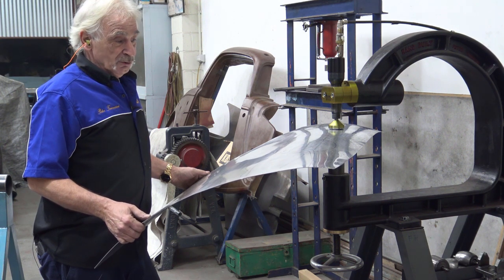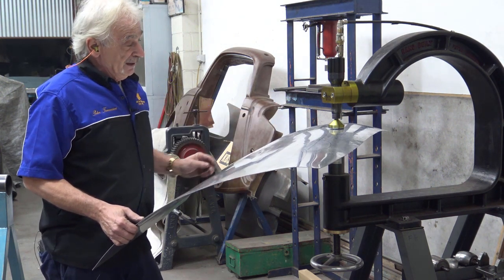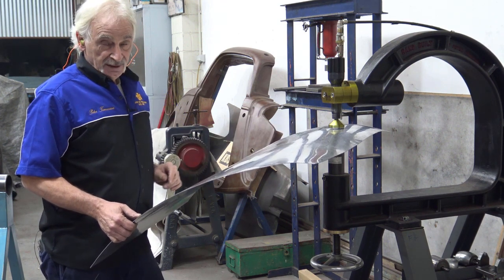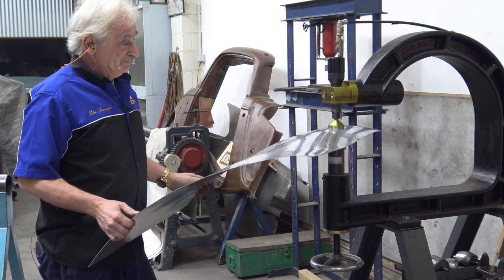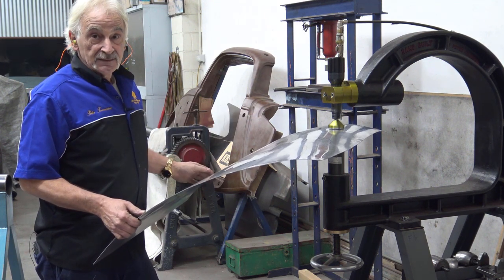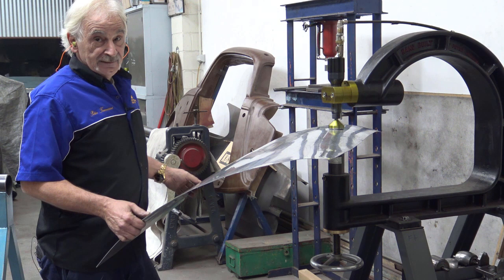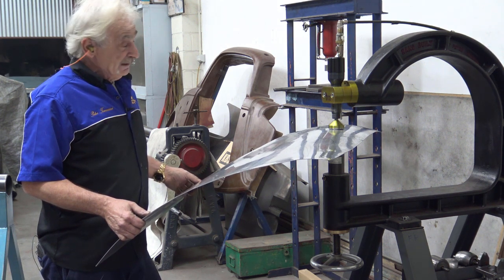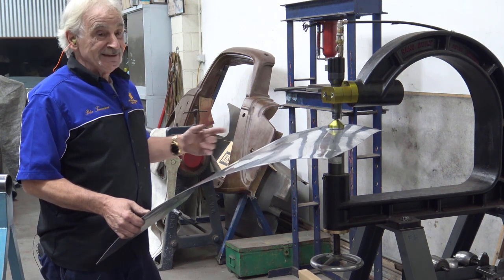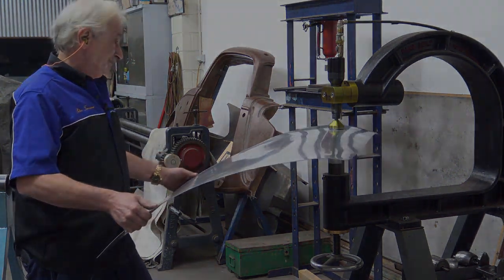And what you see me doing is keeping away from the return, putting some shape up there, and very, very lightly blending it into the blue marks, if you remember, on the pattern. And if I happen to go too far, I'll just let it out. Okay, so you'll probably hear the compressor going on every now and then. So I won't do any talking over the compressor and possibly explain what I've done when the compressor switches off. So here we go.